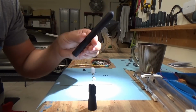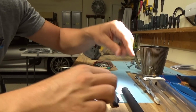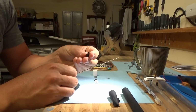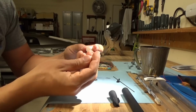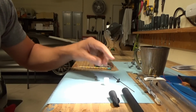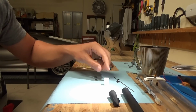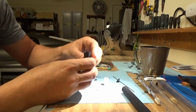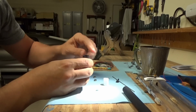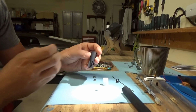you can see I got the body of the torpedo and the tail cone all to scale. These are going to be my main drive shaft for the propeller. I've 3D printed and designed some bulkheads, and these are going to house these little thrust bearings that I have. The idea is that I'm going to have the thrust bearing embedded in this back section, obviously the propeller on the back, a framework that goes up with an elastic band mounted in the middle,